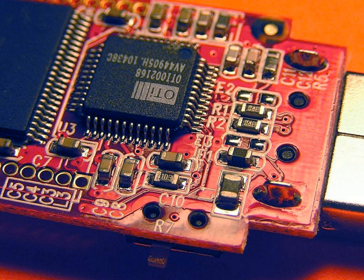Solder joint dimensions in SMT quickly become much smaller as advances are made toward ultra-fine pitch technology. The reliability of solder joints becomes more of a concern, as less and less solder is allowed for each joint. Voiding is a fault commonly associated with solder joints, especially when reflowing a solder paste in the SMT application. The presence of voids can deteriorate the joint strength and eventually lead to joint failure.